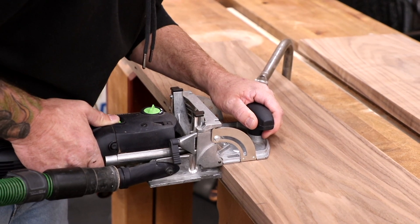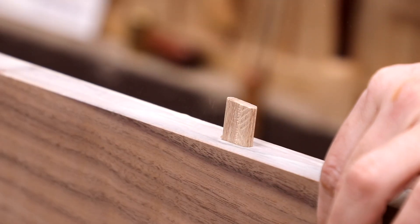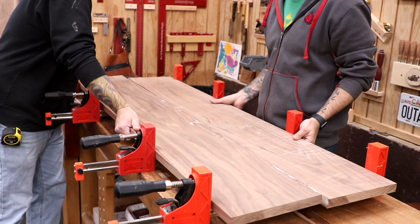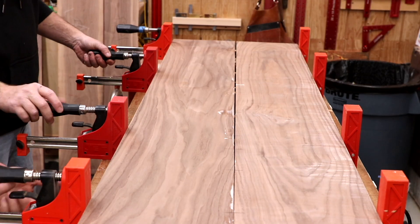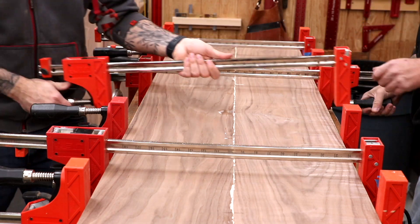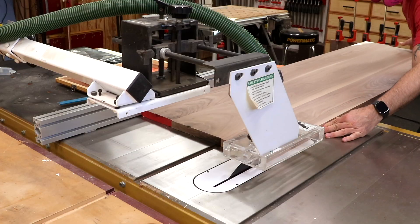Because the top and bottom are pretty long, I'll use dominoes to help keep the boards aligned during the glue-up. This isn't a necessity by any means, but it does help the glue-up go more smoothly. I also like to run a set of clamps in the opposite orientation to help keep the pressure balanced, which I find helps the panel stay flat after the glue-up.